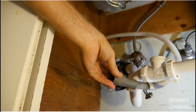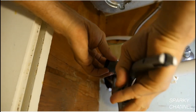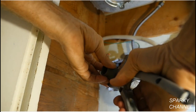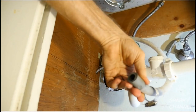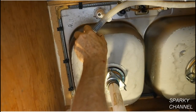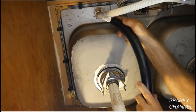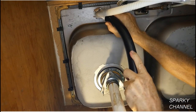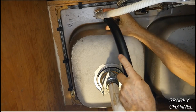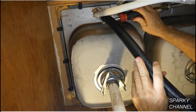This is the dishwasher hose, which comes with a variety of different size ends. Cut the end of the dishwasher hose so that the smaller portion can connect to the 1/2 inch tube on the air gap. Connect the dishwasher hose to the 1/2 inch tube of the air gap with a clamp. Now connect a piece of flexible plumbing tubing with a 7/8 inch interior diameter to the 7/8 inch tube of the air gap and connect it with a clamp.